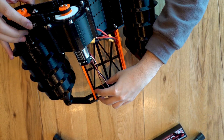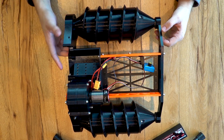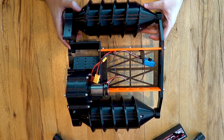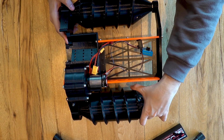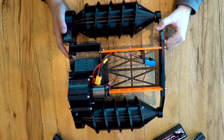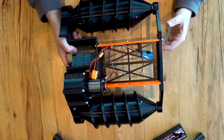Now the rollers themselves. Important for the design: you need two rollers — or at least two; you could also have four, six, or eight. It's important that they have threads on them that are spinning in opposite directions. The left-hand roller spins one direction and the right-hand roller spins the other. This means that if both rollers have the same amount of grip, the vehicle preferably goes forward. If they were spinning in the same direction, the vehicle would go sideways.